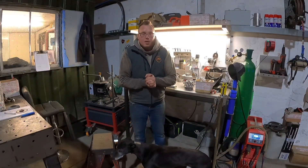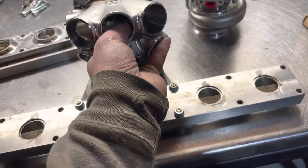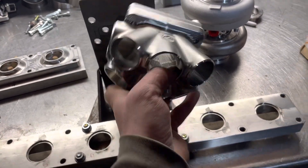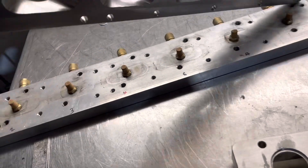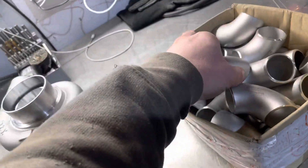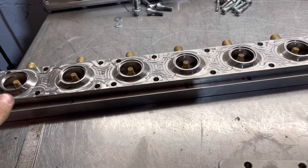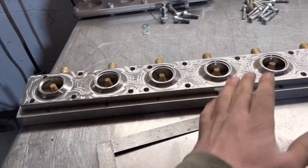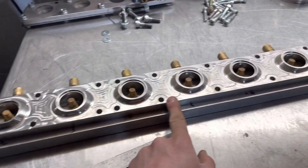We're at the welding bench — we've got all the parts ready to build the turbo manifold. So here we have the jig to make the manifold. T3 billet merge collector — that bolts on here, gives me my distance, and sets the turbo in the correct location. Then I build my primaries from each cylinder to this. This is an oval to round transition over 30mm — that is perfect fitment for the head. And then our scheduled bends, just nicely located in the top. This is something new that I've designed, trying to get a little bit of material out of it and more than anything, aesthetically pleasing. It works exactly the same but it's obviously more costly — ultimately, it looks cool.